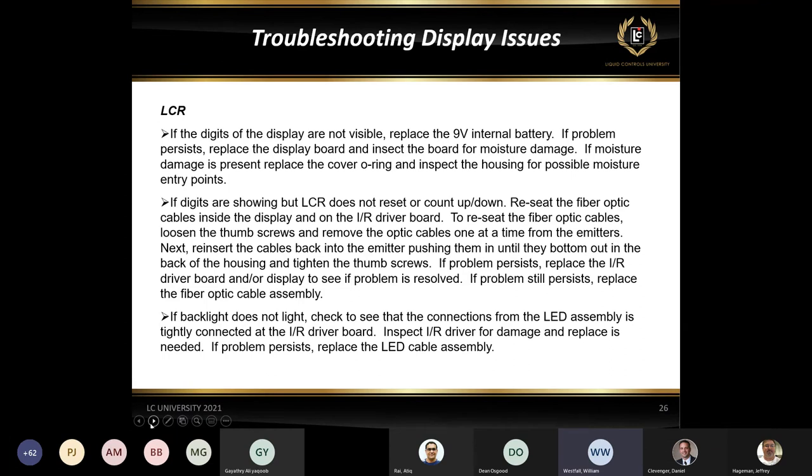So if you power up your truck and all of a sudden you go out there and you notice, oh, hey, there's no display on the front of my register, but I do get a backlight, it very well could be that the display lost its memory. And because the CPU hasn't started a new delivery and doesn't have anything for the display to actually show, it may remain blank until you restart a delivery. So if you see that, the first thing to do would be to take your red knob and move it up into the run position or start a delivery, however you may actually start your delivery, and see if your display lights up. As soon as it goes into a counter test, it should light the display up and go from there.